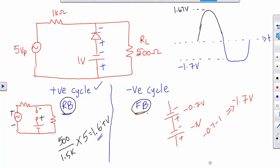On the diode we're talking about this. His question was only on the diode, not like when you add it. Your question was on the diode, isn't it? It's just the diode, not like including this one. It's just this guy right here. Because if I flip the diode around, then you would see positive 0.7, right? But it would be on that side.